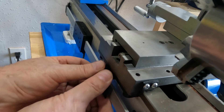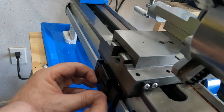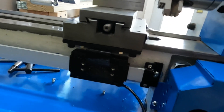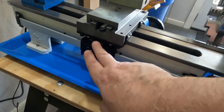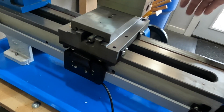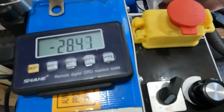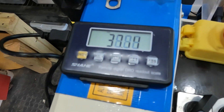I'll tighten it up and do a test fitting. This slides right in, and those holes line up pretty well, so I'll tighten it down and tighten it up to the little rear. It's mounted now — there's that little bracket piece that comes down from the carriage, hooked onto the bolt, connected to the reader. It goes back and forth and the reader doesn't seem to be binding, so that's good. If I zero it and move toward the chuck, then back away from the chuck — I've got full travel.